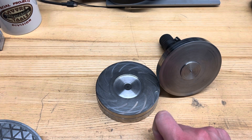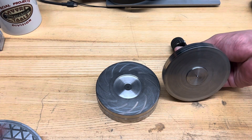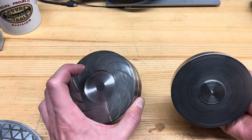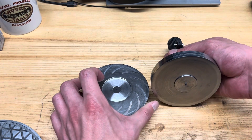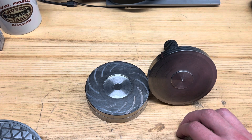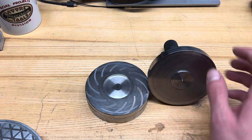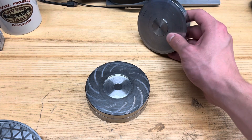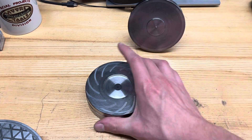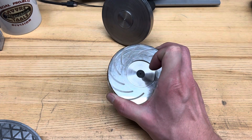That's a really neat way of making sure it's working. And surprisingly, it worked on the first try. This is just 4140, soft condition — super non-ideal — but this was a good first shot, and I think it proves the concept nicely. I'll mention briefly the lapping procedure we used for this. You'll notice these aren't super shiny, but I promise the geometry is at least decent.